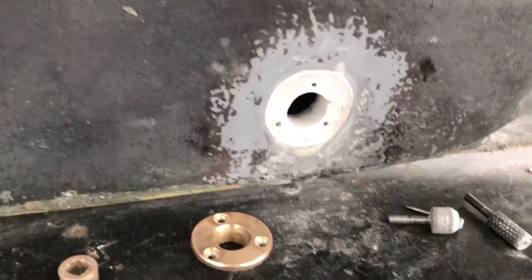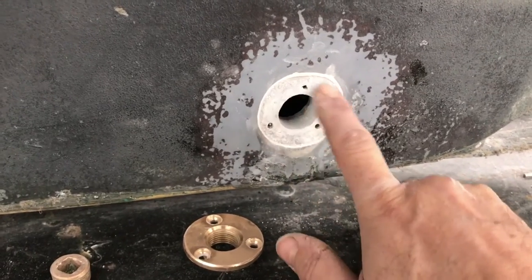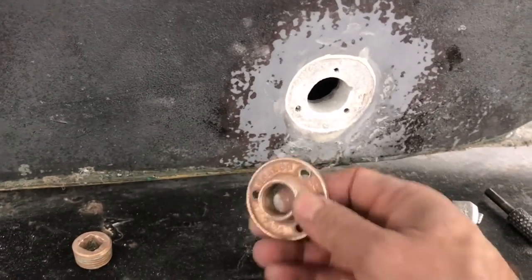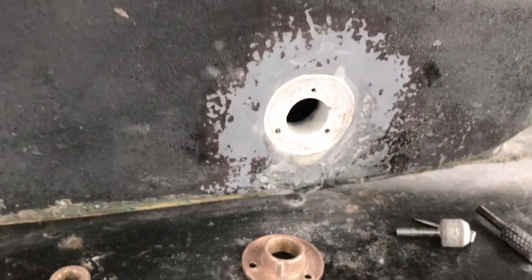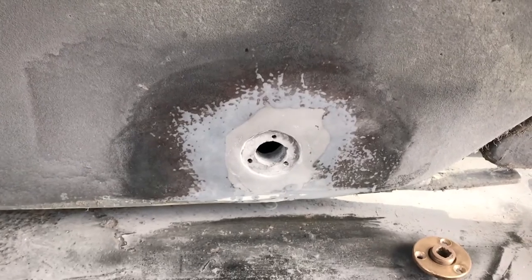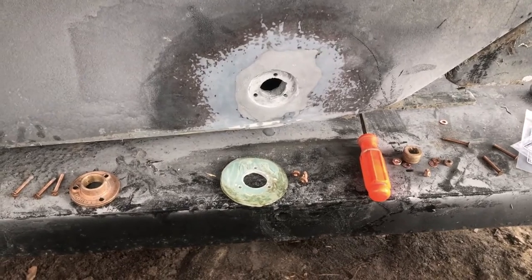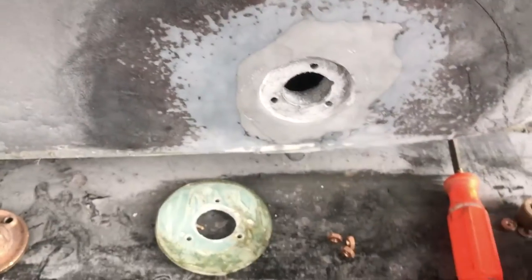I don't really want to go much further with the recessing — it's not just a hull thickness there. There appear to be some broken-off screws from long ago that someone had put in and probably tried to twist too hard. The flange has a little ridge right here and I did a small slot to accommodate it. I also sanded back the bottom paint a bit, exposing the barrier coat, and put on some barrier coat — West Systems epoxy with 422 additive — then lightly sanded.